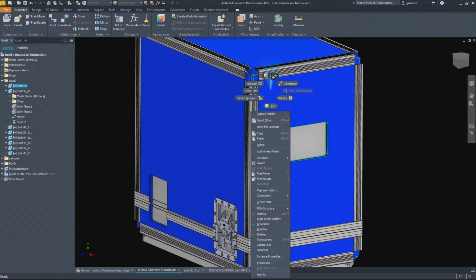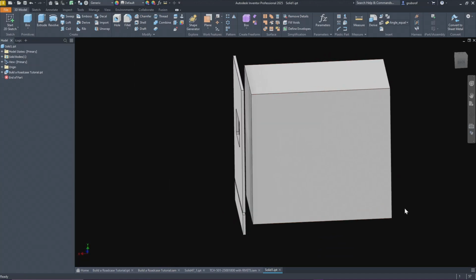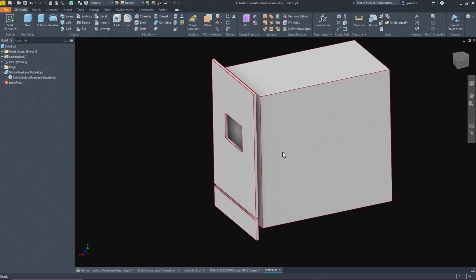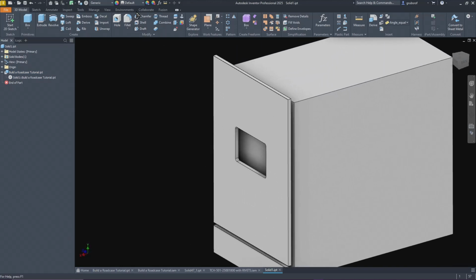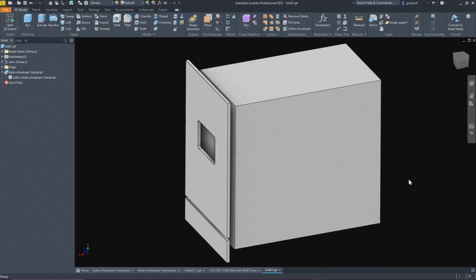Same thing. I'm going to open this up, and that happened. Okay, the box, the reason we didn't find the box, this was attached to the box. So that's why if I have to go back into the original, this is how I would fix that. So actually, I think I'll stop it here because otherwise I was going to add datums to the midpoint in that. This is why we weren't seeing the box, because that is treating it as one piece. When we did the extrusion, we didn't make sure that we hit the plus sign or the unique button to be able to keep that. That's why we didn't see the box.